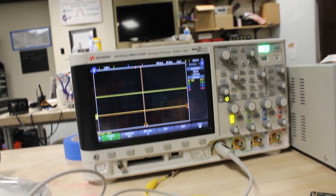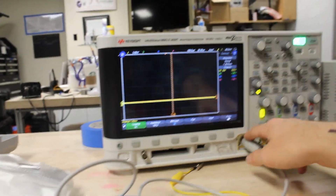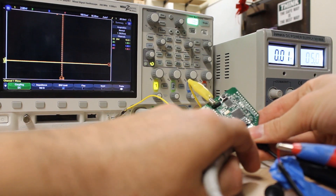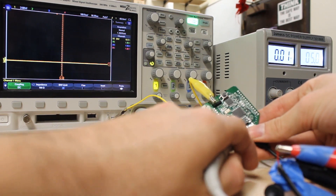Okay, I figured it out. Somebody had AC-coupled the scope probe, so it couldn't see the DC voltage. Alright, first check passed — we see the voltage in. Step one down.